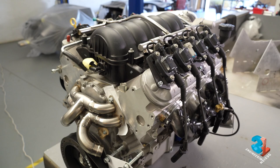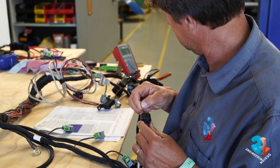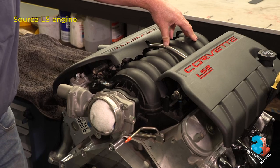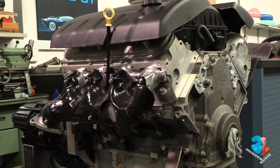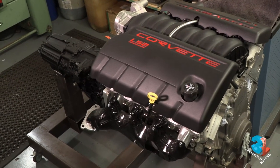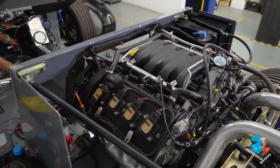Here is a conservative list of things Jean and the team have had to modify, refine and in most cases out-and-out redesign and fabricate to get the Chevy beast to work in the V8 Stealth Beetle. As the keen-eyed among you have already picked up, this is an LS2 engine — 6 litres, not the LS3 with 6.2 litres. This is what was readily available to us at the tip of Africa, but it works perfectly well for chassis development as it is the same physical size as its slightly more bored-out brother. This means the chassis can fit the LS1, 2 or 3 engine, or in fact the Audi if you want to stick with the German option.